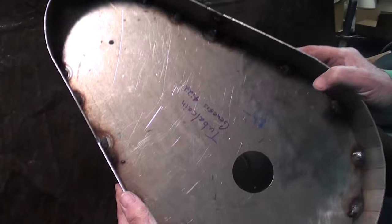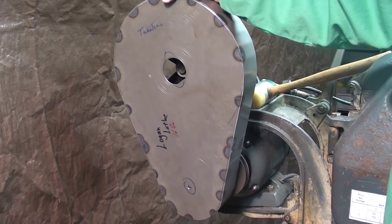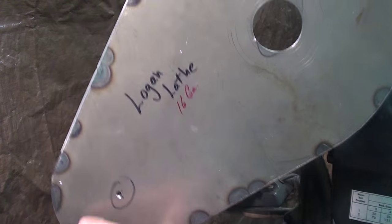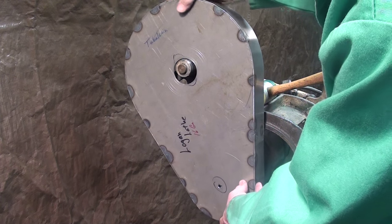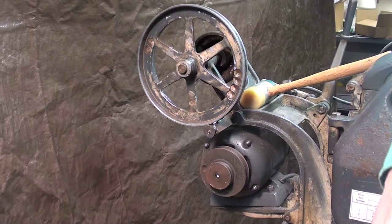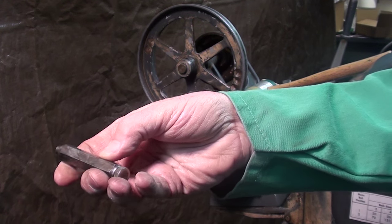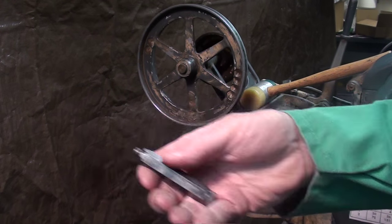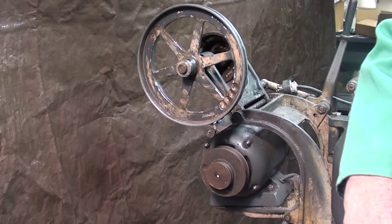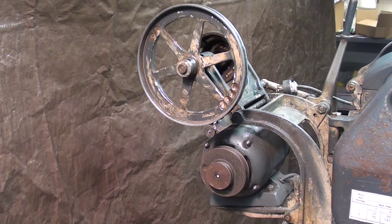The guard is basically done. See the inside of it? Just some blue marks on the outside. The reason for this little hole here is that when I put this on I can locate the center of the shaft — which I put a white spot on — through the keyhole here. That way I have oriented this the way I want it and I'm going to center the hub pretty well within this hole. In order to make the mounting hole, I have already put a transfer screw in this piece — you've seen me use transfer screws in many other videos. This is a 3/8-16 transfer screw. I'll get that all lined up, give it a good whack with the mallet so I get a center punch mark, then I'll drill the hole and we'll put it on there and see how flimsy or sturdy it is.